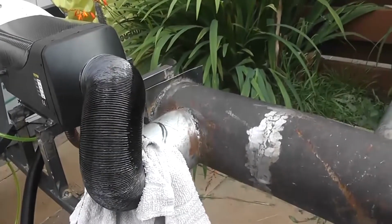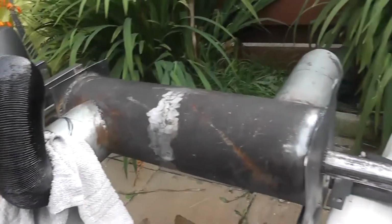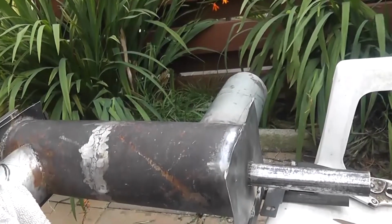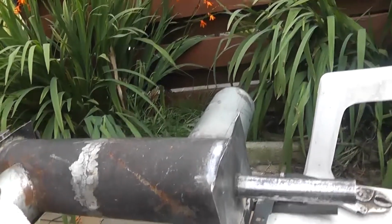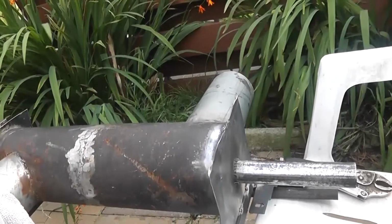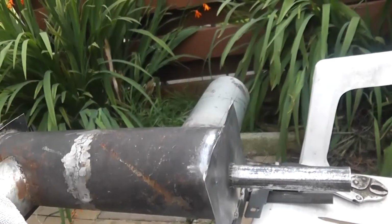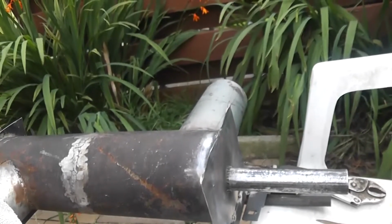Separate 12 volt, it's a 12 volt system, so I already have the power there. A 12 volt fan only runs a few amps. And I'm convinced that by pushing more air through this, I will get more efficient output. I get a bigger volume of warm air coming. It may not be as warm. I mean, nobody really needs 90 degrees Celsius heat being shot into their house. I'd much rather have twice the volume of air at 50 degrees.